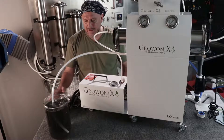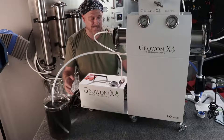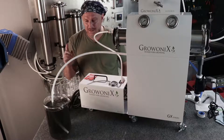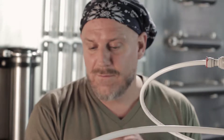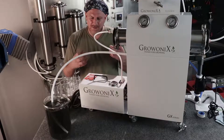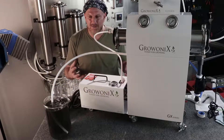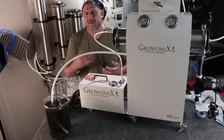After about 20 to 30 gallons, this water will clear up, the air bubbles will stop spewing out of the carbon, and it'll be a consistent stream of water — that's when you're ready to hook it up to a pump. Here's a trick: if you're not in a rush, flush it for 20 to 30 gallons and then shut it off and let it sit overnight. It's called bedding the carbon. Let the carbon sit in the feed water overnight, and the carbon will bed down — all the fine dust will separate from the main chunks, the dust will come out on the next flush. Bedding the carbon is a way to keep the dust from coming out right after you flush it, to stop dusting off completely.